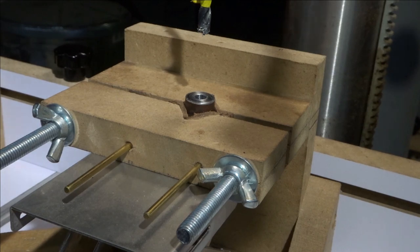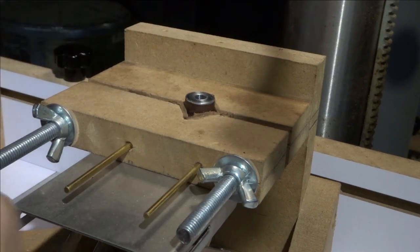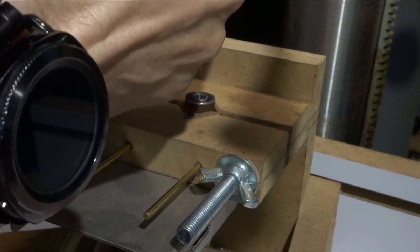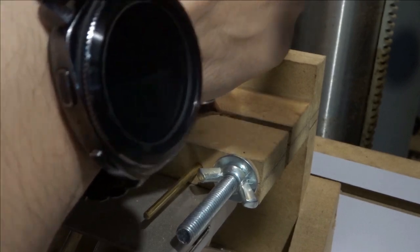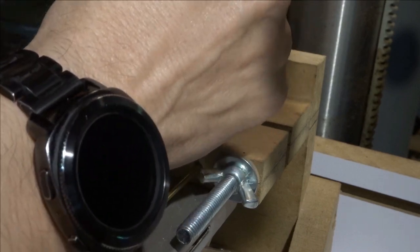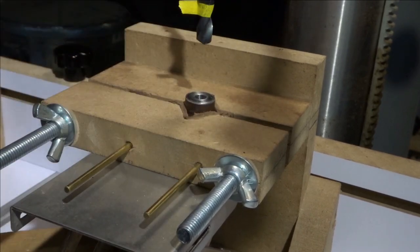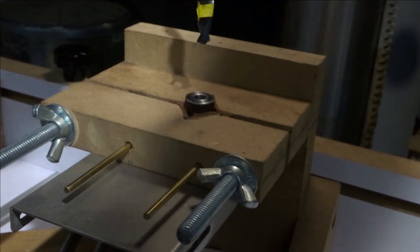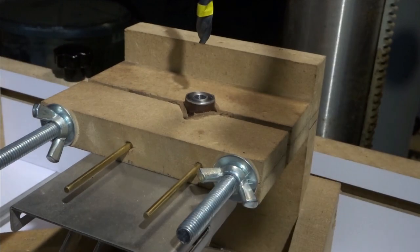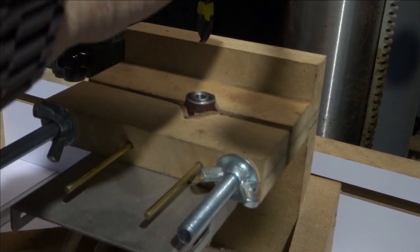Smoothly. So now let's switch over to the 5/16 bit, and hopefully you can see the importance of keeping that stummel rigid and getting it aligned properly. Because if this was off center, of course, that'll put the tenon off center, which will then put the stem off. It's the same process that I would use if I was doing a tenon replacement on a stem, although I usually will do that in a 4-jaw chuck on the lathe.